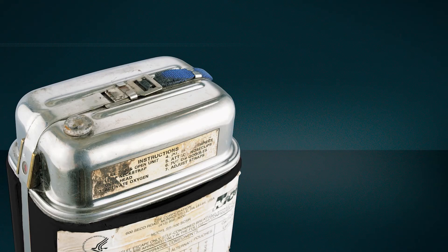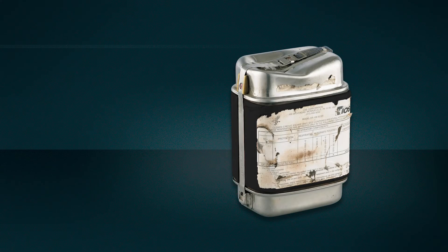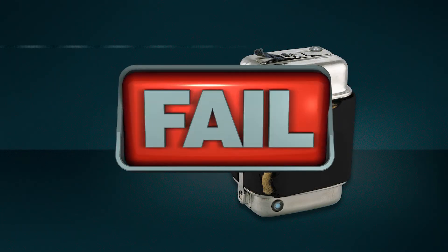Now let's check for some signs of external damage. An SCSR that's been opened accidentally can fail even if the covers are still in place and the starter tag hasn't been touched. Watch for loose or bent security bands, cracks or punctures, dented covers, and loose, dislodged or damaged rubber seals. All of these SCSRs must be taken out of service due to excessive physical damage.